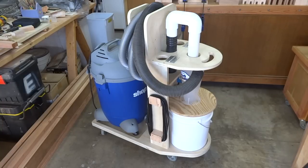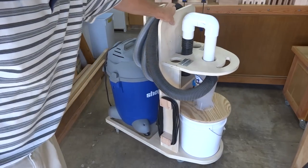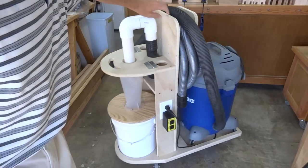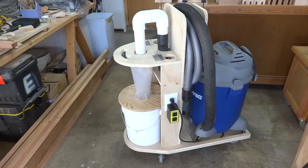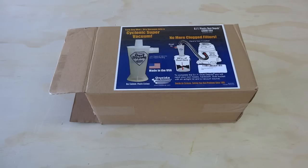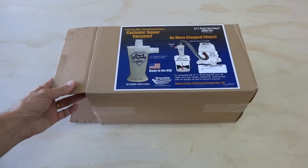I have been struggling for the past few years with shop vacs in my workshop, as the filters become clogged so quickly that I really could not use them for extended periods of time without continually cleaning the filter. My previous shop vac's motor burnt out after the filter became clogged while I was planing some boards. After doing some research, it looked like some kind of first stage filter option would solve the problem, so I